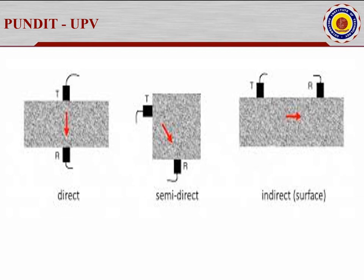In the semi-direct method, transmitter and receiver are placed perpendicular, and in the indirect method both are on the same side. These methods help identify cracks. An important requirement for both rebound hammer and UPV testing is that the surface must be dry. When wet, results have more variation — similar to how your body feels lighter in a swimming pool. The concrete should be in a dry condition for exact strength calculation.